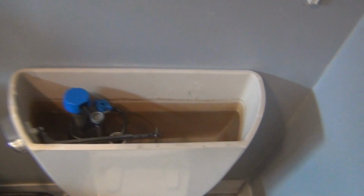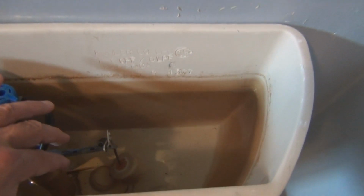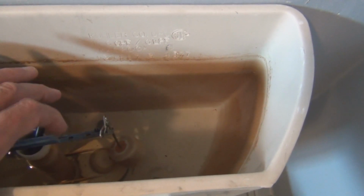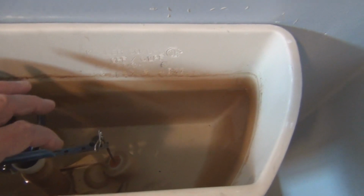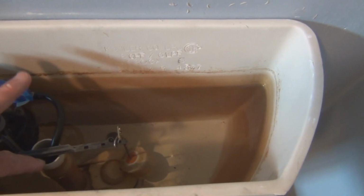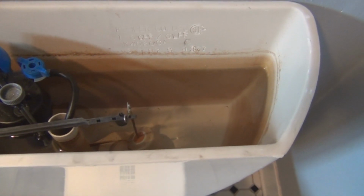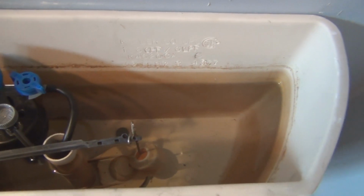So to make sure I get this terminology correct, this is the flush valve, which consists of this flapper, and the flapper seats on the bottom portion to create a seal. And then there's a sponge gasket that goes underneath the nut that holds this flush valve assembly from the other side. The gasket goes up over the plastic nut.